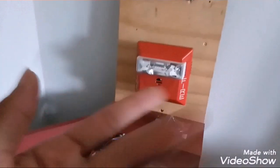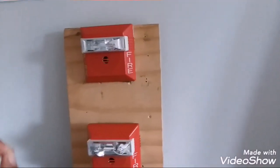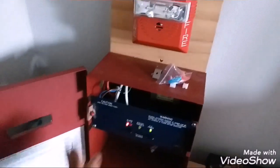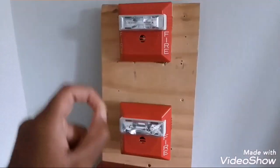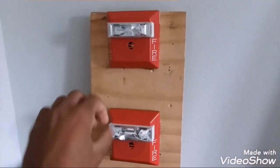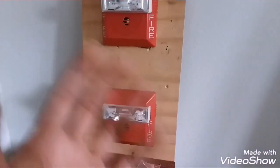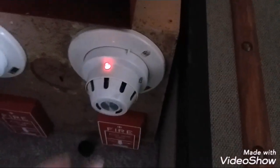The Wheelock synchronization protocol actually takes a little bit longer to silence. I don't know if you heard the rhythm change of the sync module when I cut power to the audible circuit — that's how you get your audible silence. It pulses a little bit differently to make the horn stop but keep the strobes flashing, which is really nice. Let's go ahead and blow this detector out.